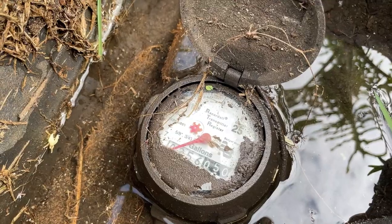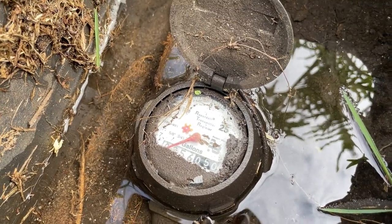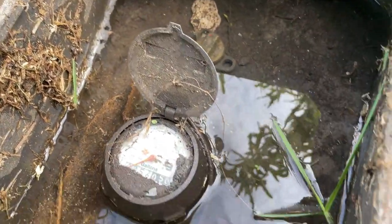The plumbing gods were with me today — you saw how much water was sitting underneath this manufactured home. That would have been miserable to crawl through first thing in the morning. A quick note about this particular community: they built it in the 80s or late 70s, dug out a bunch of lakes, and the marl, clay and fill from that digging is what they built these foundations on. So even in the driest time of year there's always water sitting around on the ground. That's how all that water got under the trailer — not from a leak, but because it sits in the grass, can't drain, and rolls up underneath. A lot of these places might have leaks on those old lines they don't know about — thus higher water bills.